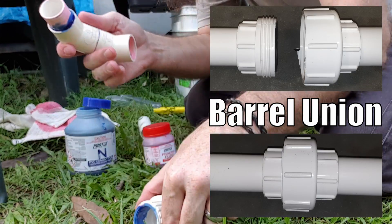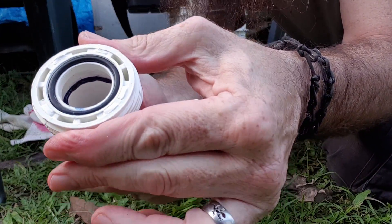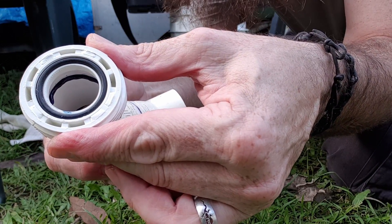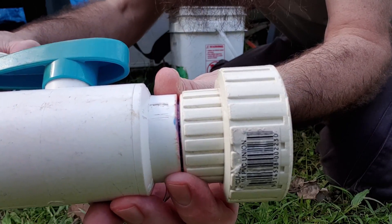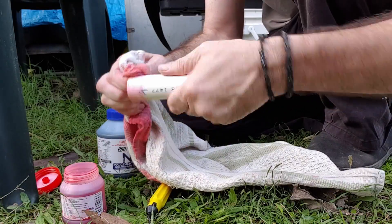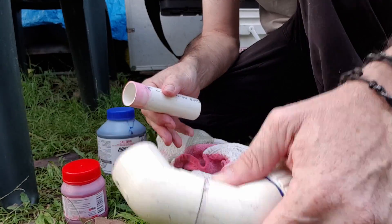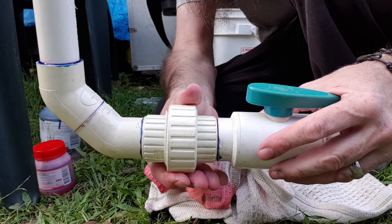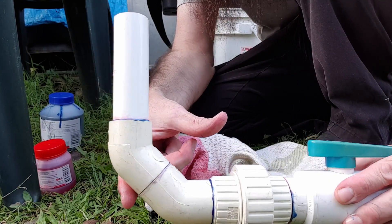This fitting here screws together — I'll do it in front of the camera so I'm getting a little bit of a blue line through there, trying to make sure I don't drip any blue. I dripped some down over that surface before, but it didn't touch the rubber seal, so hopefully it won't cause any issues. This other section I've already glued onto the other end, and you can see where it's separated just a wee tad — no huge drama. I just realized there's another bit of pipework I need to glue on this. So that's that section there glued with the barrel union. It's actually going to look like this: fish tank, valve, barrel union — so we can remove this section — and then the twin 45 to go up into the base of the radial flow settler.